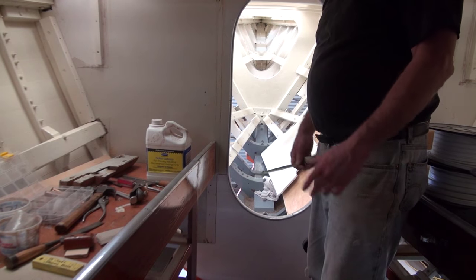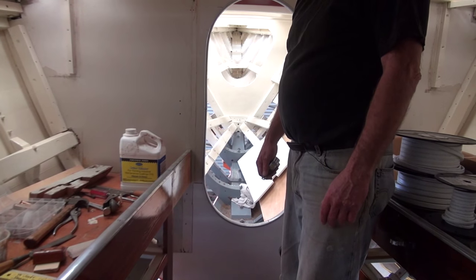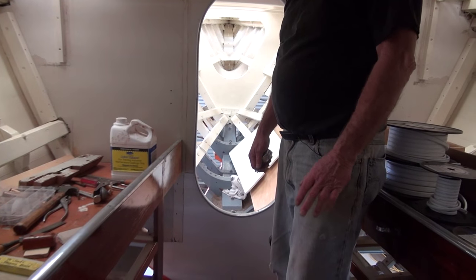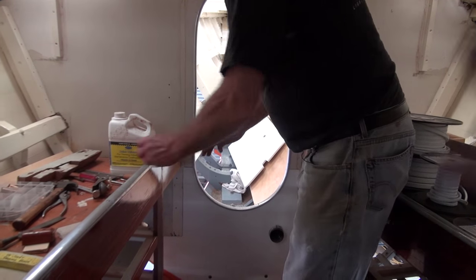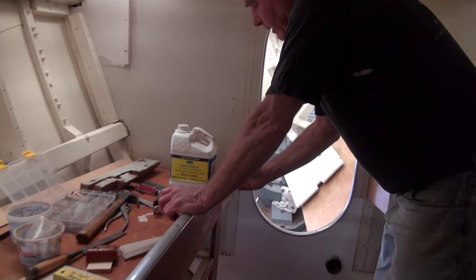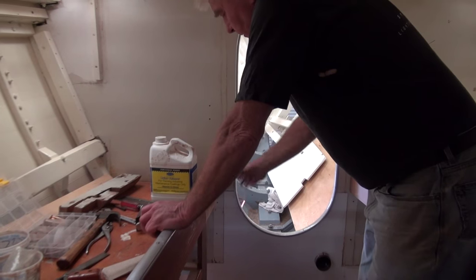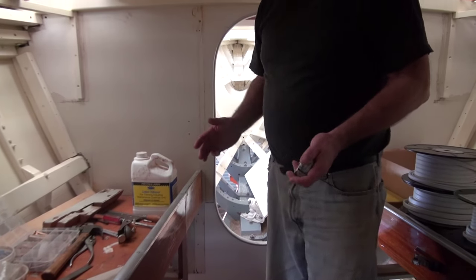You lost the closet but you're going to gain some storage. As we work this little cabinet into this angle, we're not fighting the middle. Then we'll go to where this line just about appears again. The new cabinet face mounts flush with just about three-quarters sticking out with a nice round corner, so it'll kind of look like original equipment.